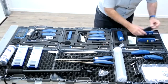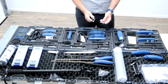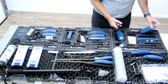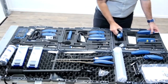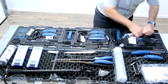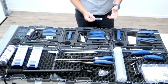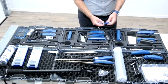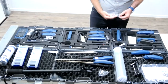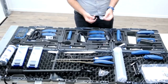We have a handheld pin probe that we can get many different types of pins for. So we've got our handheld pin probe, our hygrometer, our dielectric ball meter, our timber meter, and our hammer probe here. Really nice, sturdy hammer probe. You get non-insulated pins and insulated pins. And also we have our little pads here that can go on the handheld pin probe to do non-invasive, and it does, I think, down to 3 or 4 mil in the timber.